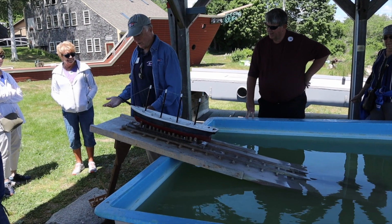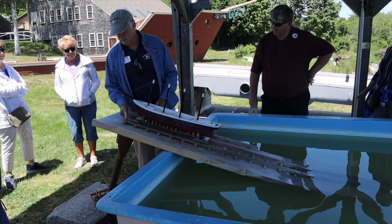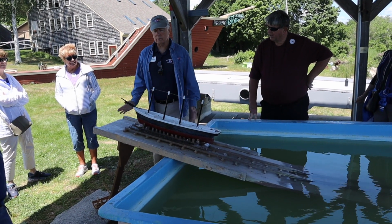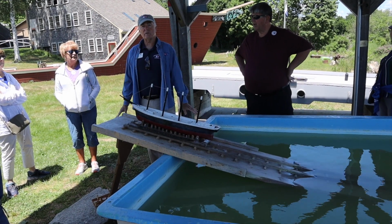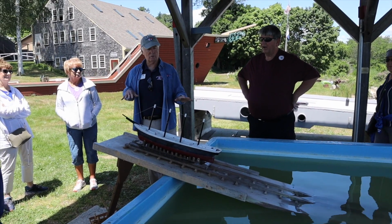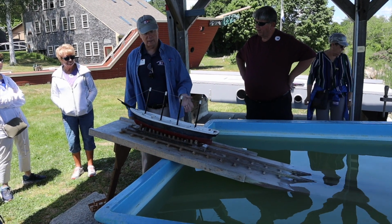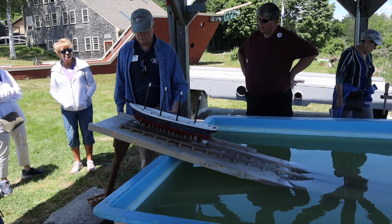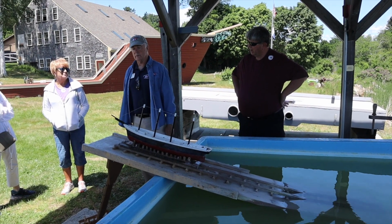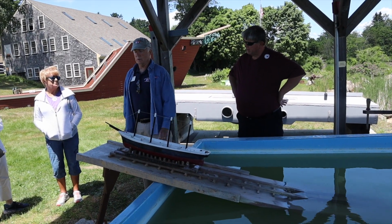Then they had another launch on a particularly hot day. All the lubricant oozed out in between the slipper beam and the standing way. They knocked out every single keel block under the vessel and couldn't get it moving. They fired the master builder on the spot. Every yard had a master builder, who supervised the construction and launch of the vessel. Fired him on the spot, hired another one. They worked 2.5 or 3 days, rejacked the vessel, re-greased between the slipper beam and the standing way, put new keel blocks in. I think they got it in the water on Monday morning. Really embarrassing. So again, these were uncontrolled launches.